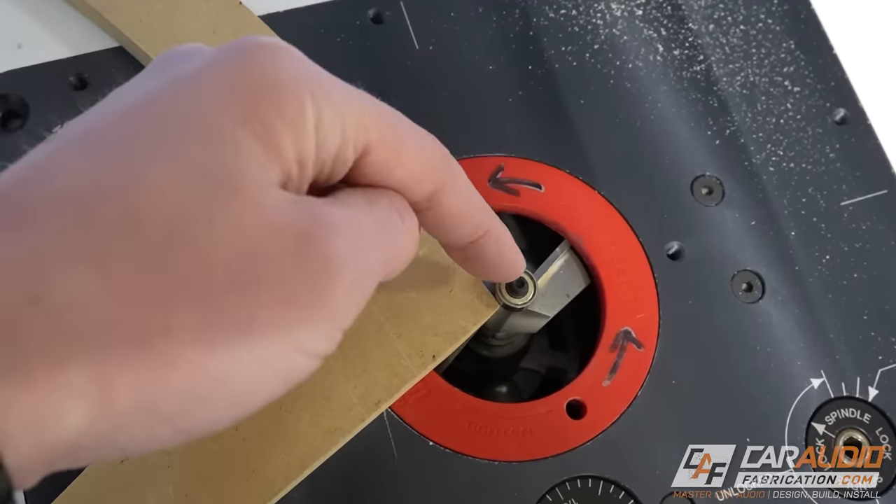After adding threaded inserts everywhere needed on the enclosure and doing a test fit with all the mechanical fasteners, I can transition to adding magnets. An important side note: off camera I've also used that Forstner bit to drill additional clearance holes for the tops of the bolt heads. For example, this fastener sitting on top of that surface would prevent the faces from mating, but since I've added that Forstner hole, this piece can go over the fastener and be perfectly flush. It looks like there's a gap but that's just the rabbited groove — the faces are sitting flush like they need to.